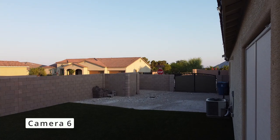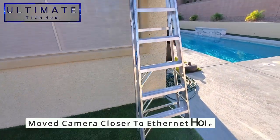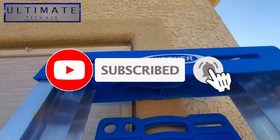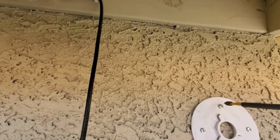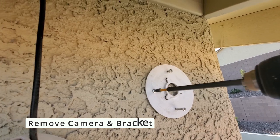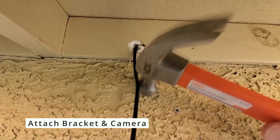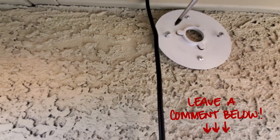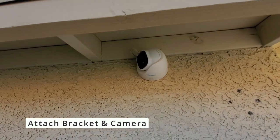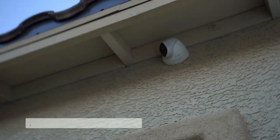Now onto camera six. I'll show you how we moved camera six to a better location with no wire. It's really important to hit subscribe and the bell icon so you're notified when we post a new video. No matter which Reolink PoE camera you buy, the installation is pretty much the same and it's really simple. The tricky part is mounting the camera in the correct location and then running the wire from the camera to the NVR system. Mount the camera as close as possible to the wire drop location for a clean look. After mounting, go back and patch and paint those four holes. This camera covers the side yard as well as the RV parking. And this is after we patched the holes and painted them — looks good.